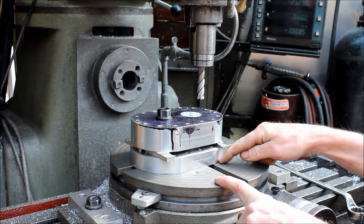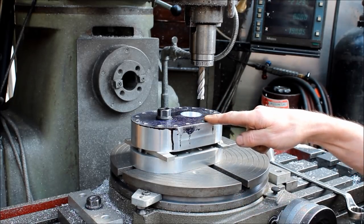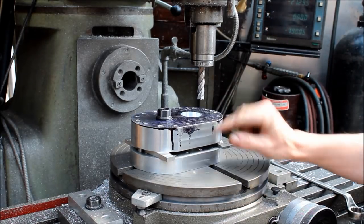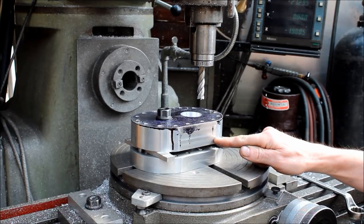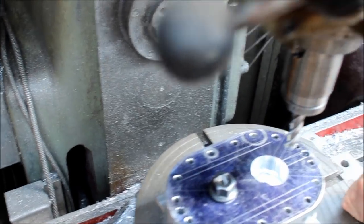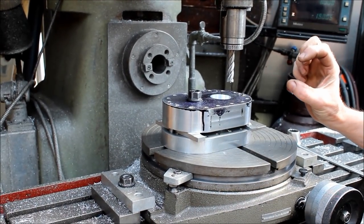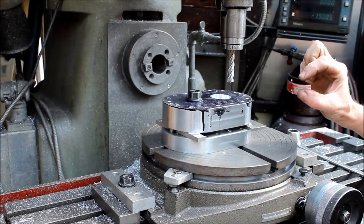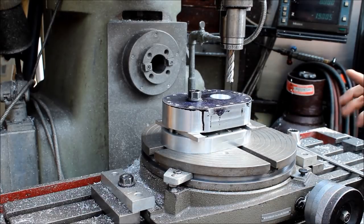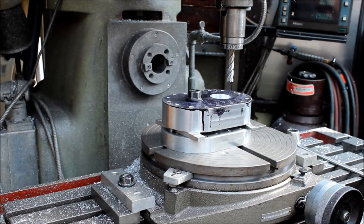We've done the pilot hole for the case. Then there's a certain depth for the seal. What I've done is I've allowed about three mil - there is a little lip where the rotor shaft comes through, it's about three mil. And what I've done is left it about four, because what I need to do is get the plates - once I've got the info here, I can skim that to get everything aligned.